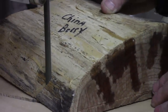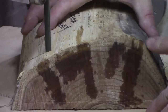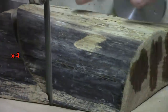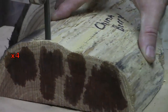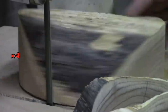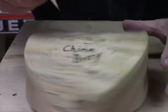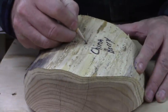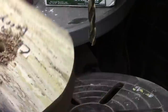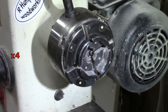The most important part is making sure that your line comes out directly from the front cutting edge of that blade, otherwise there's going to be too much side stress as you're cutting — it makes it less safe. Somebody recently also asked me why sometimes I use this circle cutting jig and sometimes I don't. The best time to use it is when you're working with logs and you've got an uneven surface and can't really mark a circle, like on flat stock where you could just hold it up to the saw and follow the line and cut the circle.